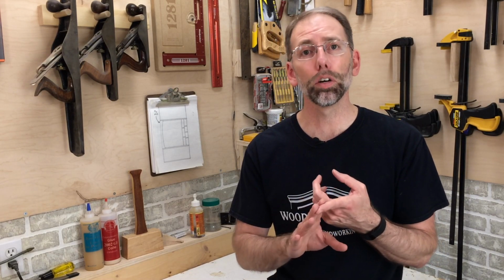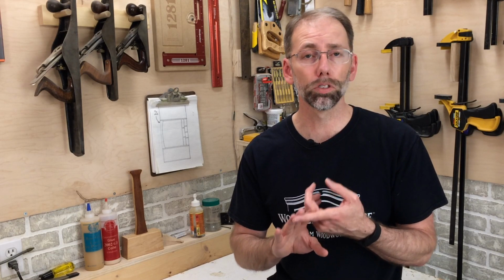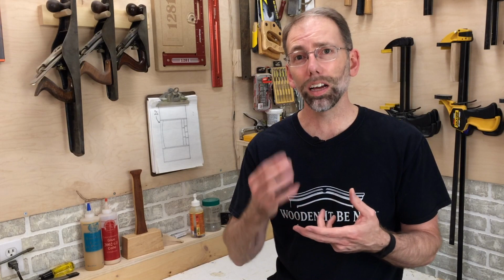After talking to my furniture finisher, I realized why I was so confused about these types of finishes. There are shellacs, which are not that durable and susceptible to damage, so he recommended staying away from those. There are oil-based finishes, which have a lot of dryers in them and a lot of chemicals, which means you need an NIOSH approved respirator and organic filters to protect your body from that damage that they can cause. The third is acrylic. And acrylic is the new generation, the new technology in finishing. And that's the product he recommended for me.